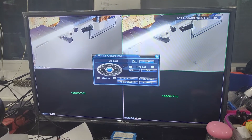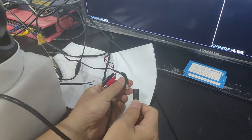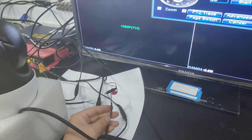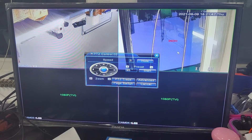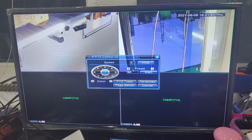And we will reboot it. This is very important: after you change the soft address, cut off the power and reboot it. Now the camera is rebooting. After rebooting, you will find the soft address will change to number 2.